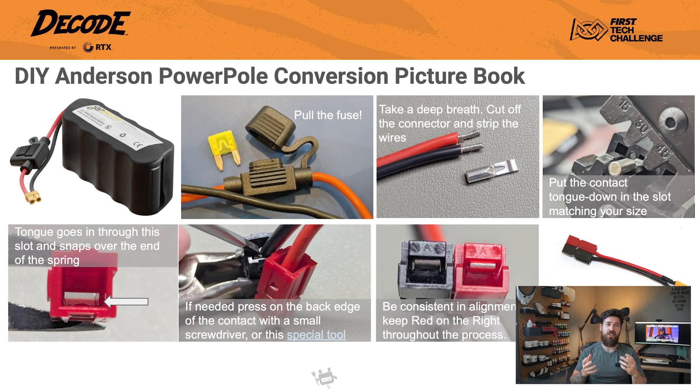To install these properly, you're going to need a special ratcheting crimp tool that's really designed for them. Don't even try to use regular pliers because you're simply not going to get a reliable crimp. The downside of the Power Pole is it's a little bigger than the XT30s and costs a bit more — but maybe the savings you got from skipping a battery beak can help you pick yourself up one of these. So the recap: keep your batteries charged, don't run them too low, and monitor that internal resistance. Be aware of the weaknesses of the XT30 connectors, and if you can, make the switch to Anderson Power Poles. Taking care of your batteries is a simple discipline that can have a huge impact on your team's success. Thanks for watching, and best of luck out there this season.